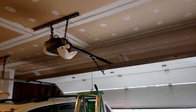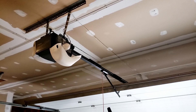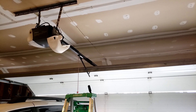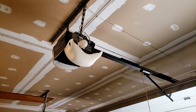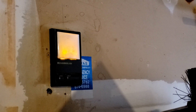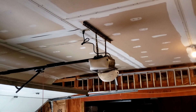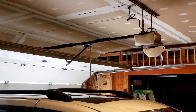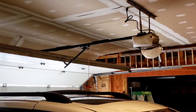So we're going to take a look at this unit and see if there's another bad solder joint. In the past I fixed a bad solder joint on the circuit board where the power supply interfaces the logic board — there was a bad joint on there about five years ago. I've also noticed that I do have power, but if I press the light switch the light doesn't come on, and if I operate the door all I hear is a relay clicking and nothing's happening. So there's something definitely going on inside with an intermittent issue.